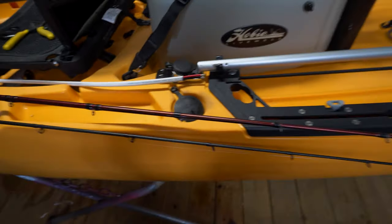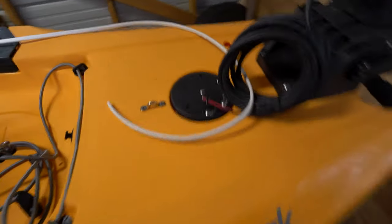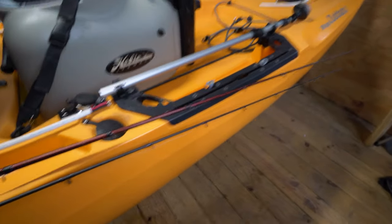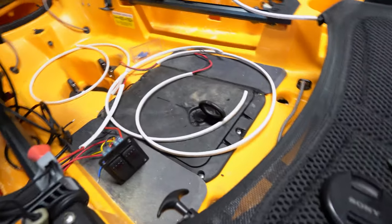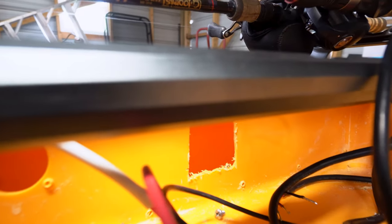For most of us I think it's actually a journey — the journey to modify your kayak. All in all, you do have to drill four holes. There's that one for the power pole, that one underneath this for the 360 light — because a lot of us do fish at night and we're close to the night hours, so you've got to meet government requirements. We have another hole drilled over here and another one over there. Everything else just runs underneath.